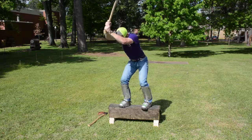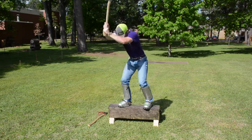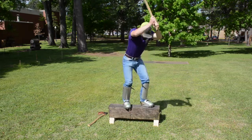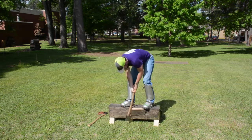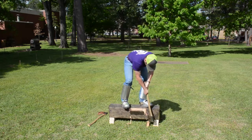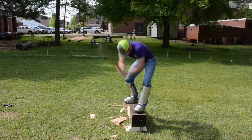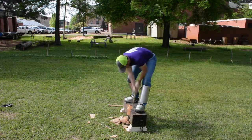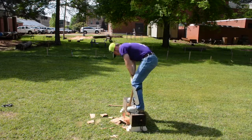There are several cutting patterns you can use, such as top-bottom-bottom-top or bottom-top. If you stick the axe, your first instinct is to pull away from the cant with the axe handle, but the best way to do it is to drive the end of the axe handle closest to your body towards the middle of the cant. Once you have cut through to the center line of your first side, you want to set your drivers, which are one to two hard swings to try and crack the other side of the wood.